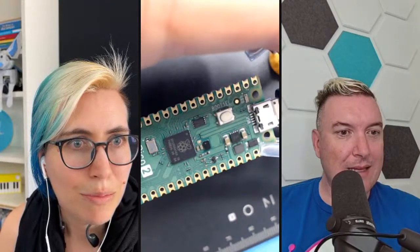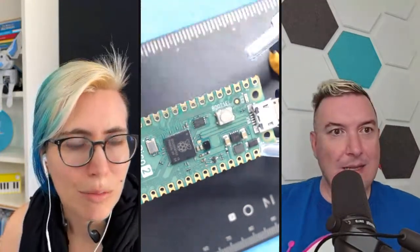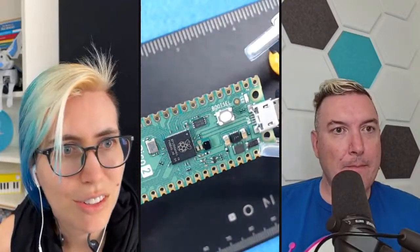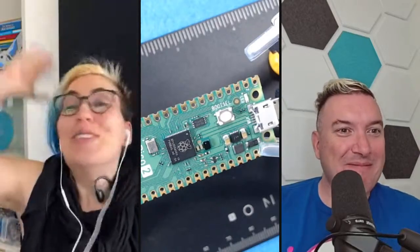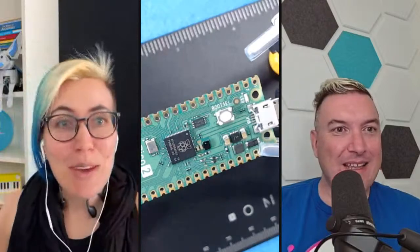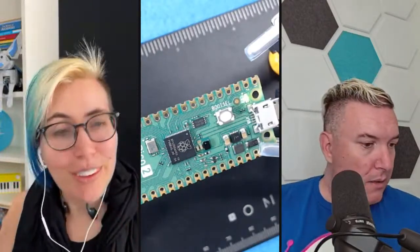Yeah, if there's button switching state or not. It doesn't seem to do anything with the LED except for turn it on at the start. I'm going to do a find just in case I'm missing something somehow. LED, LED, LED. No, that's all there is. It doesn't talk to it. Why is it flashing? Okay, so in part A, we're trying to make it flash, and it does nothing. This code only turns it on, and it's flashing.